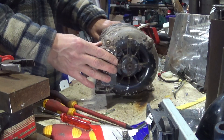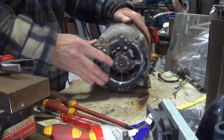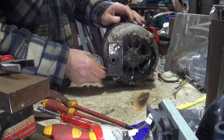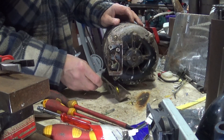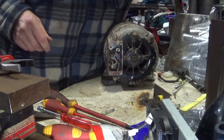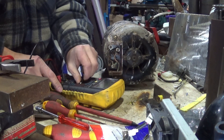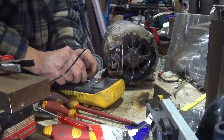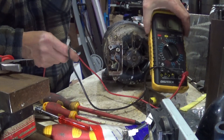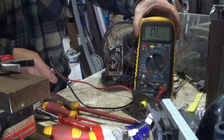What we're going to do is just show you the tests I do before I buy a motor. The junction box is stiff — that will have to come out and be cleaned right up — but for the moment we're just going to see if the motor works. What you want to do when you buy one is make sure you've got continuity in the wires you want, and none in the wires you don't.